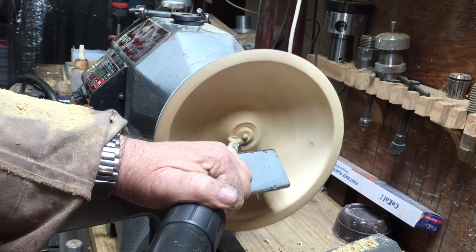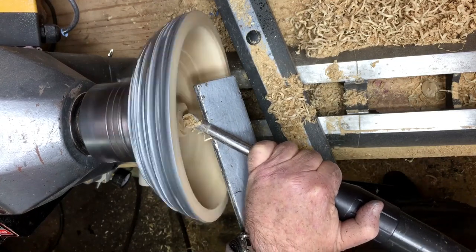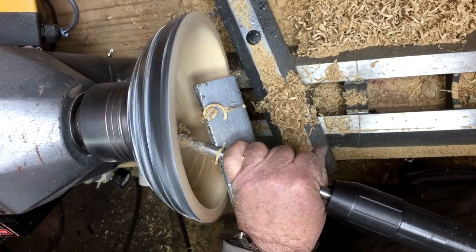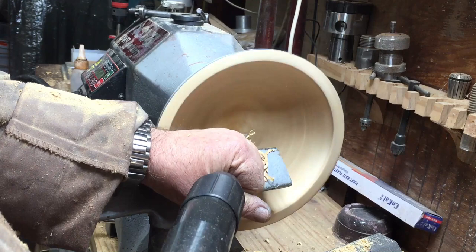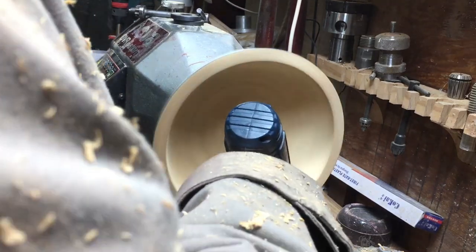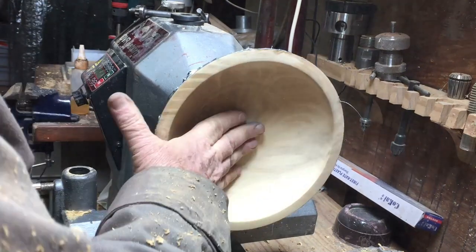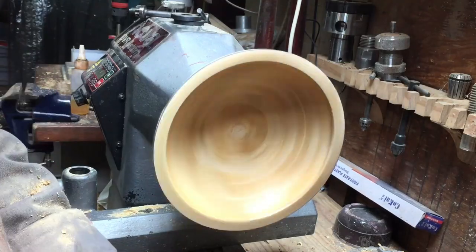As I left a very small recess in the back, I'll have to be very careful and not put a lot of pressure — I don't want it to jump off or crack the recess. The wood is a little bit porous so I'm going to go step by step, small bites — like eating an elephant. I'll go all the way from 120 to 600 grit, then I'm going to apply Yorkshire Grit on the inside. I'm not going to use resin or paint on the inside — I'll finish it with beeswax.